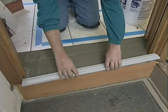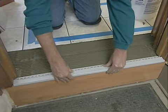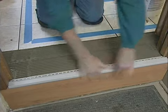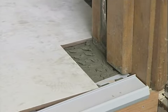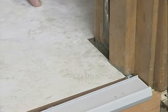Metal trim pieces are also a good option if your tile ends up being part of a staircase. If you install tile as a stair tread, the front edge is hard to support properly, and it can sometimes be damaged by the extra pounding it receives. Metal trim pieces are available that make a strong nosing for the step, and they create a surface with some traction.